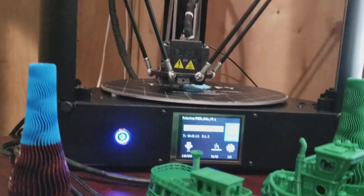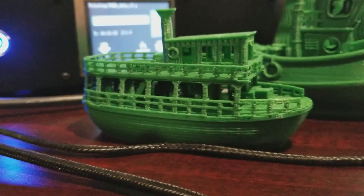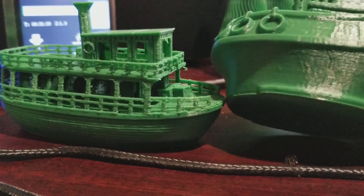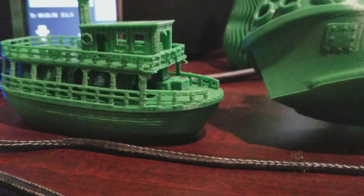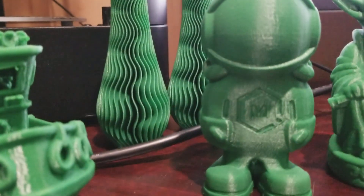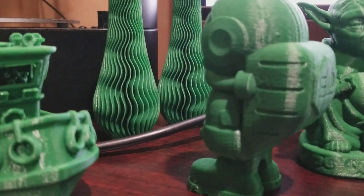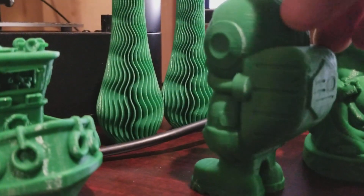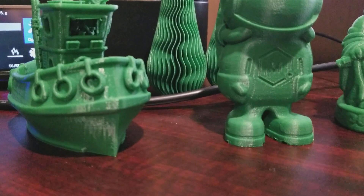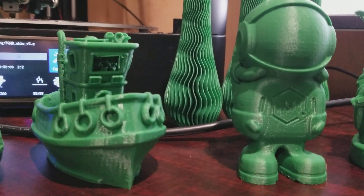Right now let's show you a few of the prints that come off it. I'm not super happy with them yet — they're okay, they're getting better. But there are just some wavy lines in the side of the hull of the boat, for example, that you can see. Just some imperfections I need to try to tune out via slicer settings. This one — not too bad, but you can see on the side of the helmet it's not perfectly round; there are inconsistencies. It looks like it was too hot, but I'm running the filament at 200. Maybe the Delta requires colder temperatures and I'll play with lowering them.